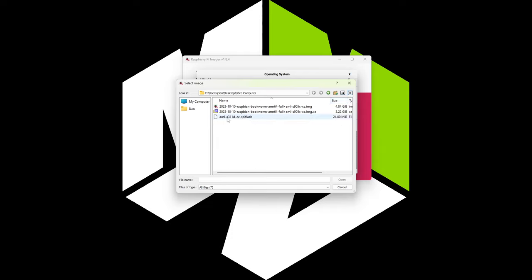There we go — it's fitting into place. Press it down and you'll hear a click. The eMMC is now installed. The SD card with the Raspbian image is still in there. Flip the board over, plug the HDMI back in so you'll be able to see what's going on, plug in the USB for Wi-Fi and for keyboard and mouse, and if you're using Ethernet that'll go in there too. Power it back up — let's jump back over to the capture card so you can watch it power up.